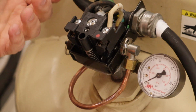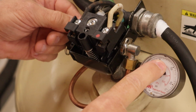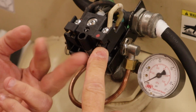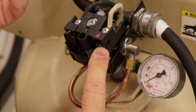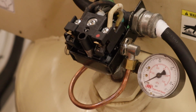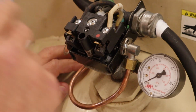I can turn it on. Had there been power, this would come on. And then, I don't know, it's supposed to go up to 130 PSI here, and it would shut off. Well, it went up to 140. I ran the switch, it wouldn't work. You see what's happening here. This little, it's plastic, this little bail. And that was actually coming undone enough that the motor would shut off, but the pressure relief wasn't working. And that's because that's not going to work unless the whole thing comes free. So had I just connected this up and let it run, it would be the same failure again. It would run and run and run. It would exceed everything. Okay, well, I'm not going to trust this switch anymore.